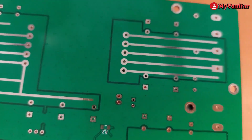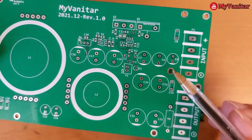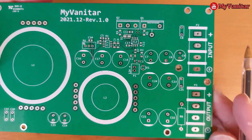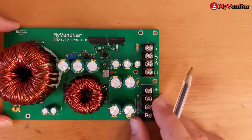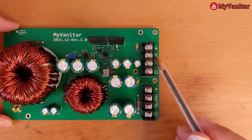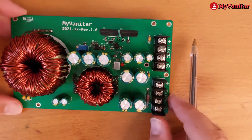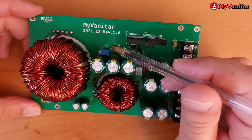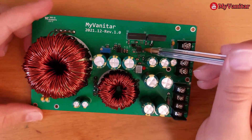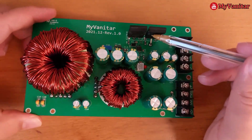The quality is pretty nice. I highly recommend you to use this PCB design if you want to build this circuit because I have followed some PCB design rules that are necessary for this circuit. This is the input connector — you can apply up to 40 volts to the input — and this is the output connector. You can draw up to 30 amps from the output, and this multi-turn potentiometer is used to adjust the output voltage. This is the MOSFET driver chip, this is the controller chip, and these two are power MOSFETs.